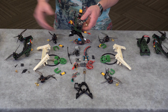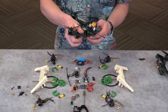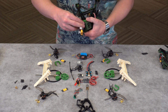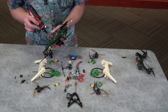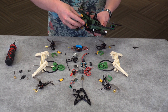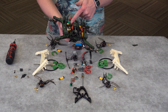For drone assembly, we'll take one of our complete electronics decks and put it inside our canopy. Then we'll take one of our motor pods and slide it in on the dovetails — rotate to lock. Then we'll take our locking clips and place them in the correct positions and lock those down in all four positions. The arms are universal so you can assemble multiple arm units if one breaks. Swapping an arm system out on the drone is very quick and straightforward. We'll button this up, plug in our quick connectors, then we're ready to fly.